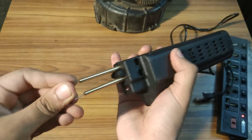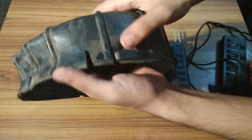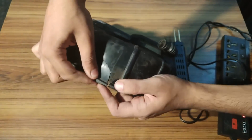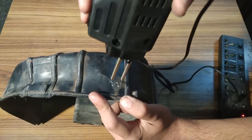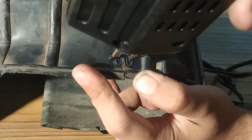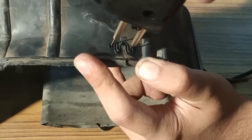While performing the plastic welding, the two broken plastic parts should be as close as possible. After that, turn on the safety switch of the welding machine and slowly push the staples halfway through, then twist a little.